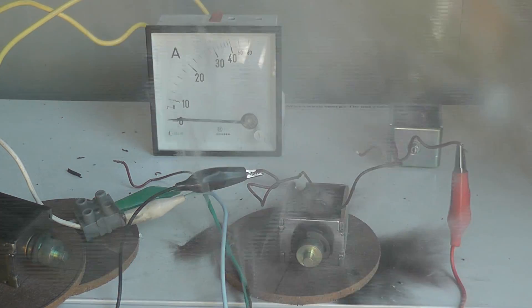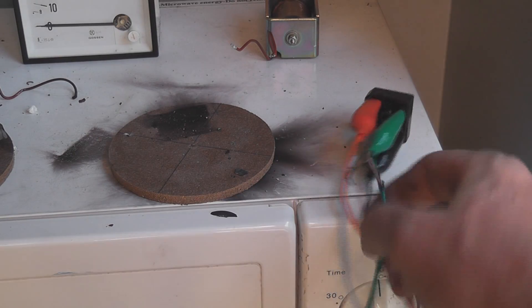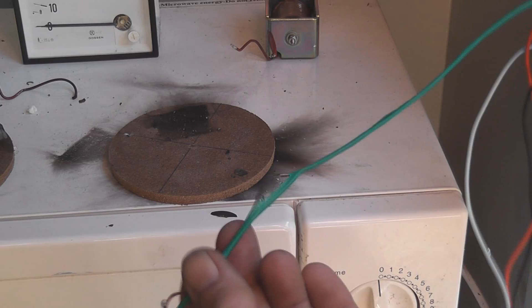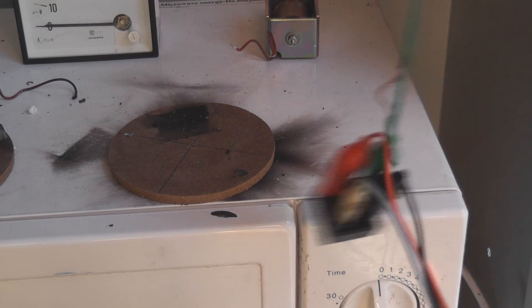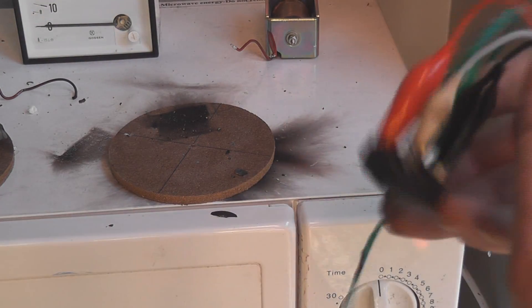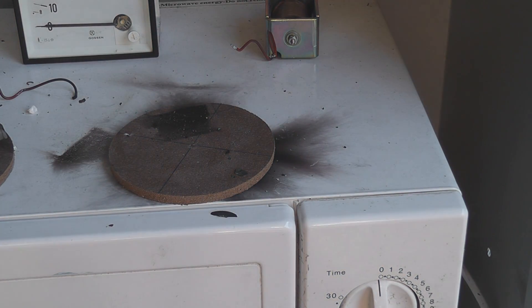Where are my leads? I'm melting my leads — I wasn't planning to do this, that wasn't too smart. These leads are not really rated for that current. Most of these alligator clips, as seen on many YouTube videos, are rated maybe for 5 to 10 Amps for short periods and that's about it. The green one is burnt out, the red one was just about to smoke. So the block rectifier is hand warm. Learning exercise there.